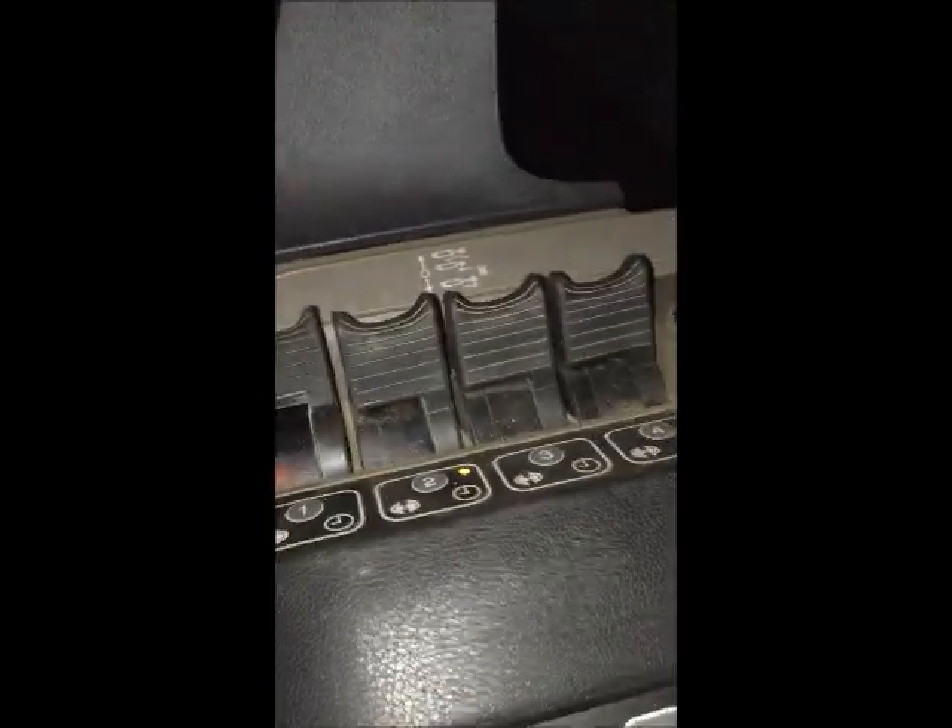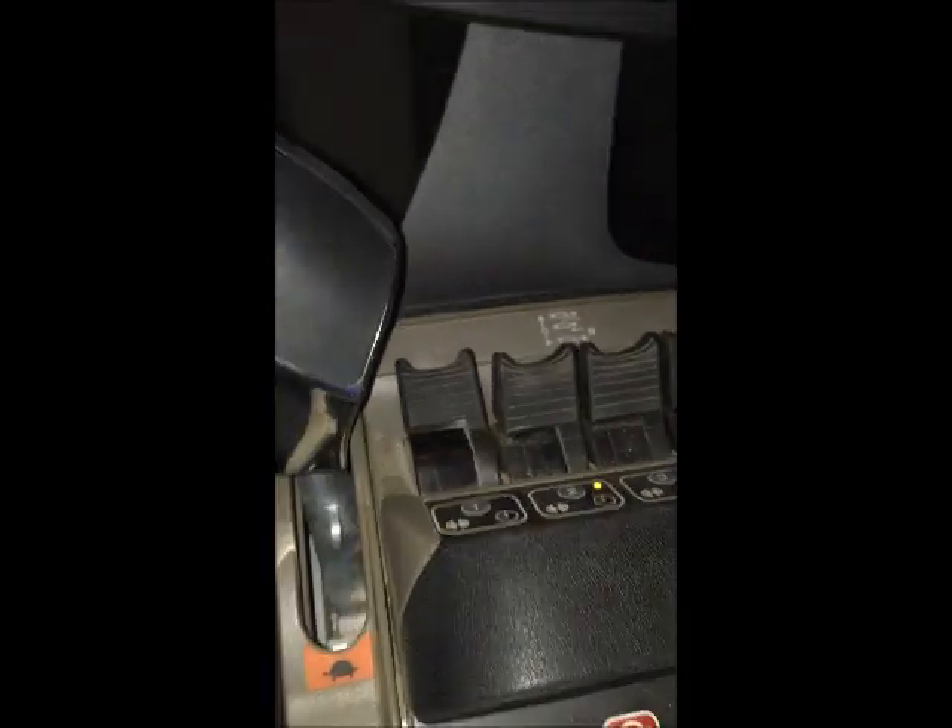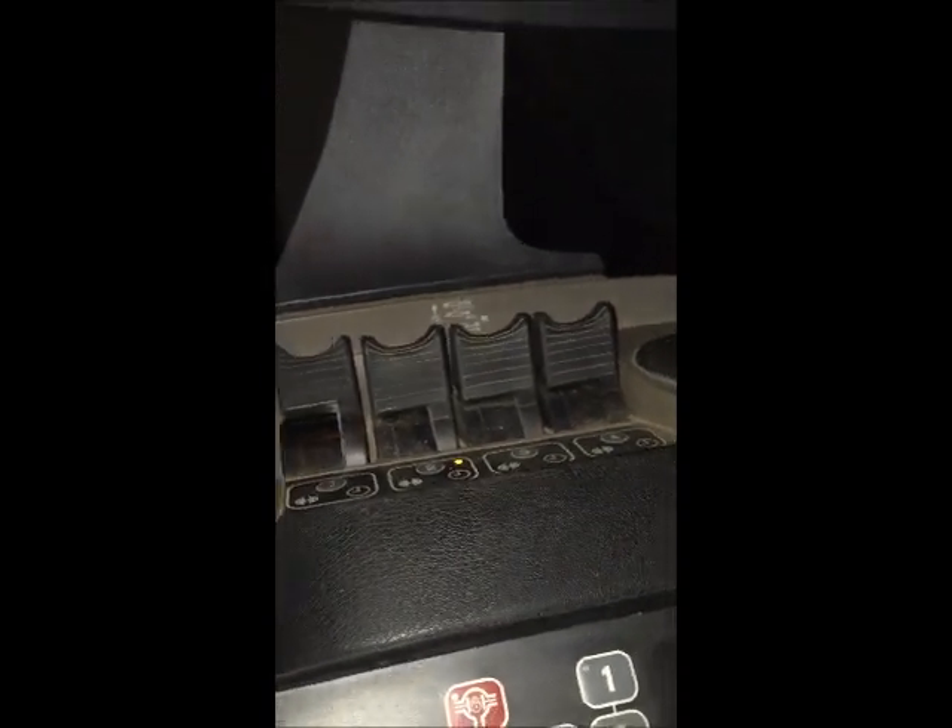We'll continue here with a few more of the controls. All of this is on the armrest that you see. You come up here and you've got your four different hydraulic remote controls. The one on the left and down lifts the entire tool. The next one lifts just the disc gangs. The next one lifts just the rolling baskets. And the fourth one lifts the wings of the entire unit.